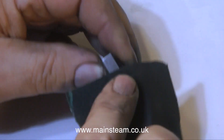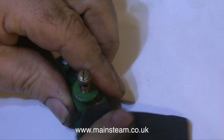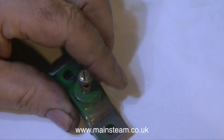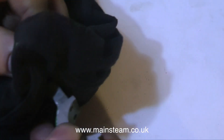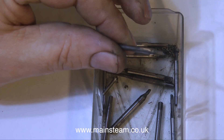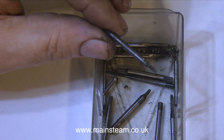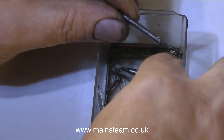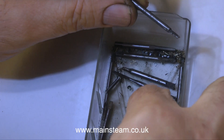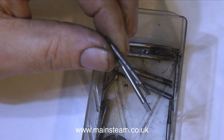Igor, fetch me the brain! Young Frankenstein's the better film, I think. I drilled two holes all the way through the casting from the outer edge to the middle, then reamed them to one-eighth of an inch diameter. I needed two very strong one-eighth inch pins. The shank diameter of an 8BA tap is exactly one-eighth of an inch and it's very hard high-speed steel. I selected a couple of broken 8BA taps, ground off the tap part, and ended up with two dowels. These were pressed into the holes with Loctite 638. If it breaks during the build, I'll remachine the part; if it doesn't, it's obviously fine.